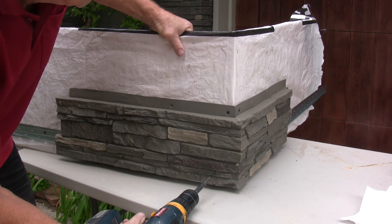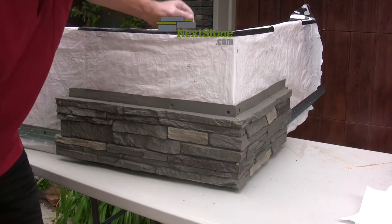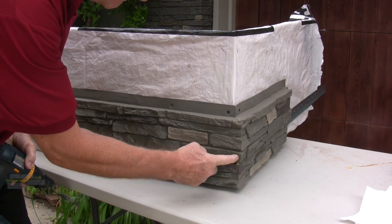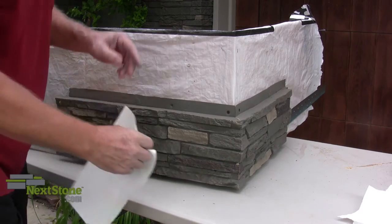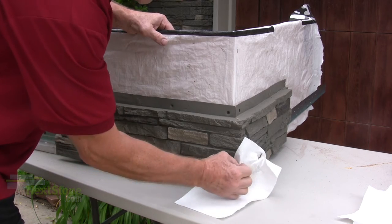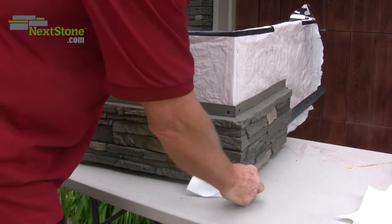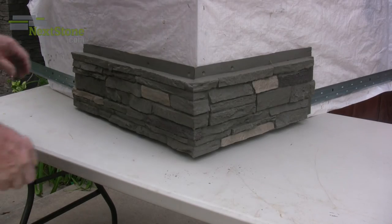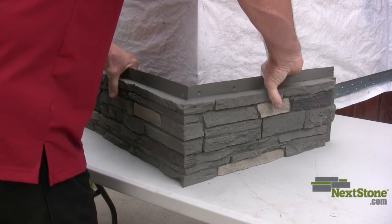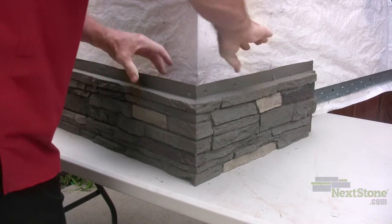Find places underneath the overhang of a rock and drive screws into the substrate to pull the bottom and middle of the panels together. Use at least one additional screw on each side of the panel. Wipe away any additional glue that is squeezed out from between the panels. The polyurethane adhesive makes a chemical bond with the polyurethane of the panel, which creates a very strong contact point.